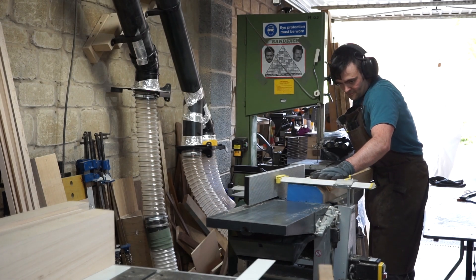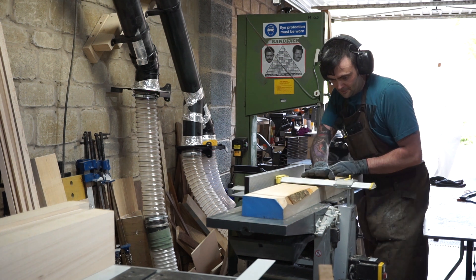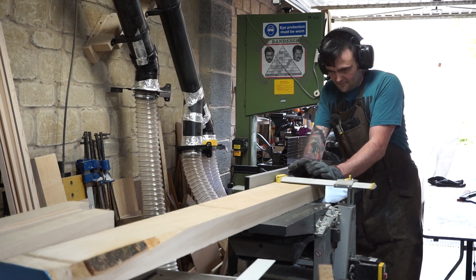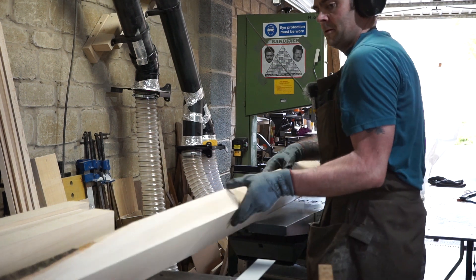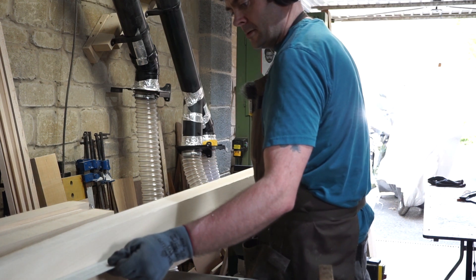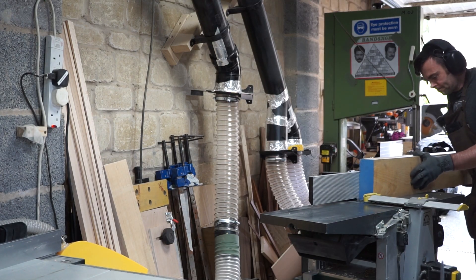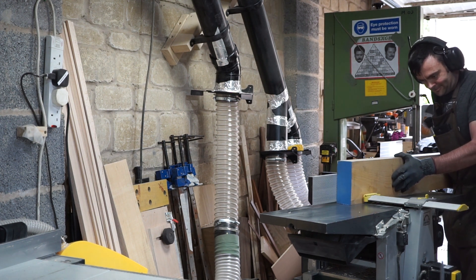As with all projects I use rough sawn timber, so I start by face planing each board. These boards were cut to rough length for me by the timber merchant as they wouldn't fit in my car otherwise, but even so they're all still well over five feet long and very hefty. I ended up with 22 boards at this length, so when you consider that each board requires multiple passes, the planing and thicknessing ended up taking about three and a half days. Off camera I then glued up the components for the legs and stretchers and replaned them once dried.